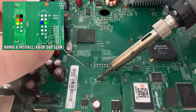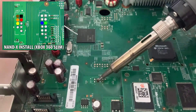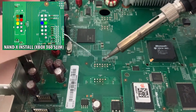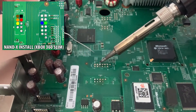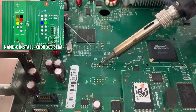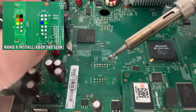These might take a little bit of time to get the solder on because they've most likely got a coating on top. You can use a sharp object like a blade, or sometimes you can lightly rub with the top of your iron — though I don't usually recommend that because it can damage the iron. The other ones you want to do are one, two, three down. If you have flux, please use it; if not, go buy some. It helps a lot, makes solder points neater, and helps things attach to the points more cleanly.